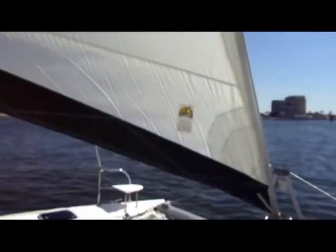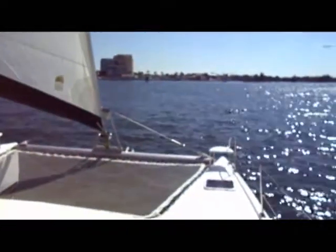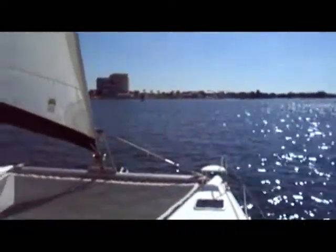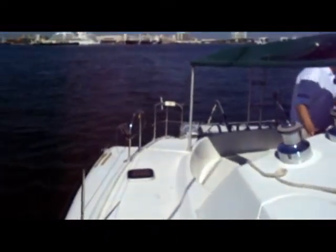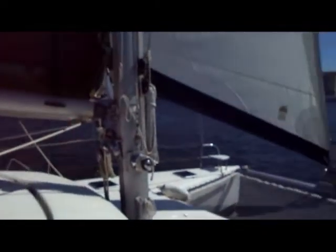Leech cord and accoutrements look good on the Genoa. Furler's working good on the mainsail. We've got a double reef, which is good. It's a single line reefing, and then you tack it down at the base of the mast on the luff. In any case, everything looks good out here today, and engines are running without any problems, which is as expected, and just all in all a nice boat. We've also gone ahead and tested the autopilot, which is on a remote, and it works as well. So not a great sailing day, but a nice boat nonetheless.